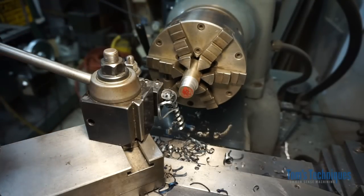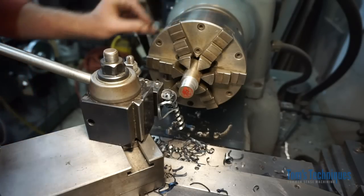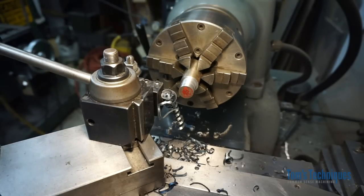You can see the chips are almost white — that's a lot harder than you normally want to push a tool bit. But the fact is, even after being heated up to a red color with a torch, it still cuts. So we don't have to worry about overheating a tool bit when we're grinding it, if that tool bit is made of high speed steel. That's about all I have on this one. Clean up the lathe and I'll see you next time.